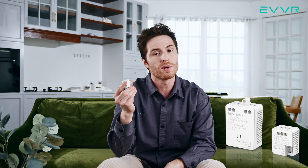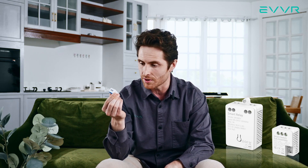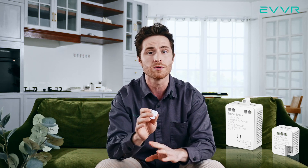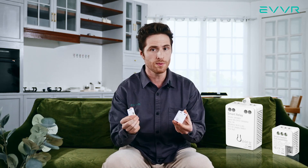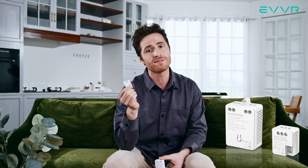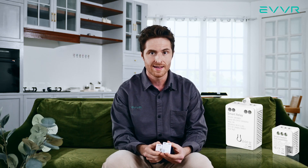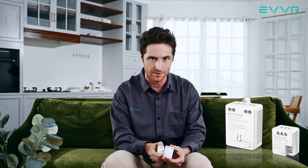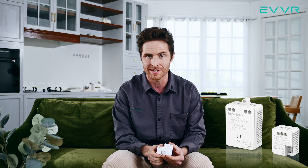For the smart switch sub-assembly, this installs near the mechanical switch for the light itself. It's incredibly small, incredibly compact, and needs no neutral wire for installation. Two of these can fit in almost any electrical box, which means this supports up to four gang wall switches. Although this is a two-part product, you don't necessarily have to install the smart switch sub-assembly if you don't plan on using the mechanical light switch to control your lights. However, we do still recommend installing it because doing so ensures that the smart relay in the lighting fixture always receives power, which means even if you accidentally turn the mechanical light switch off, you can still control the smart relay over Wi-Fi.